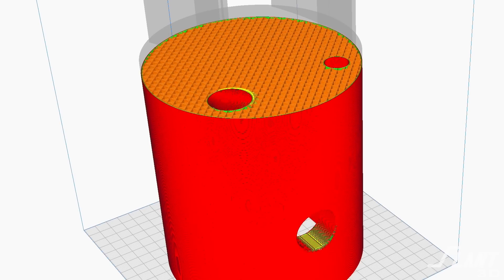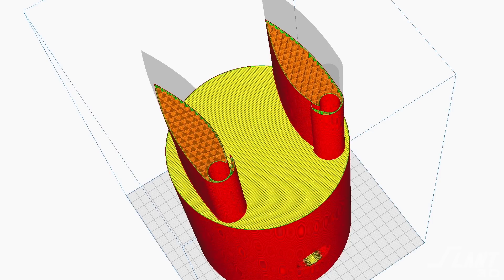The vanes themselves have some internal channeling that splits the air from the motor into two vanes, which then comes up into two slots so it can blow out. On top we designed airfoils that allow the air to follow along and ideally entrain and drag along air, so as the air flies quickly over the airfoil it drags more along with it. For a first shot built in 24 hours, it works pretty darn well.